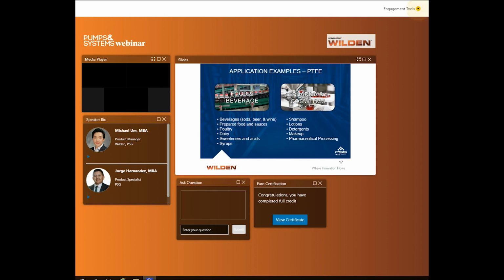Pharmaceuticals. This application requires no entrapment points and ease of cleanability. An IPD diaphragm will meet both requirements. You don't have to worry about the outer piston getting in the way or causing any unnecessary abrasiveness to the diaphragm, causing early failures. There are high cost losses if product leaks, and an IPD can remove any unnecessary leak points.